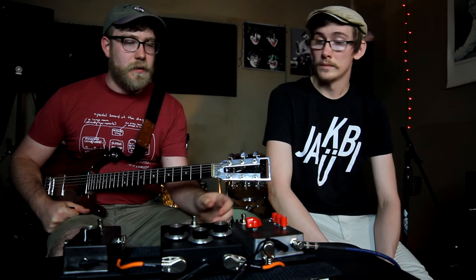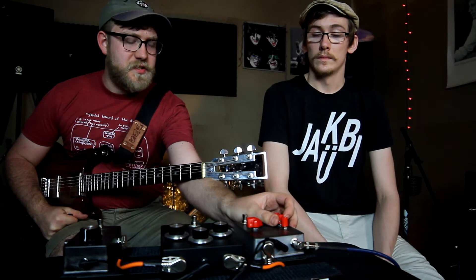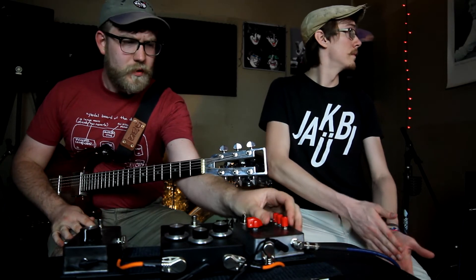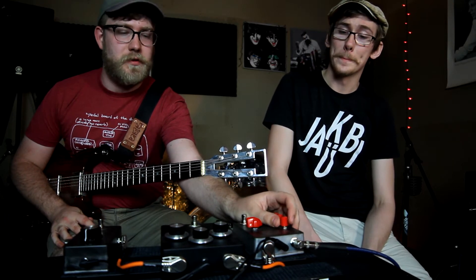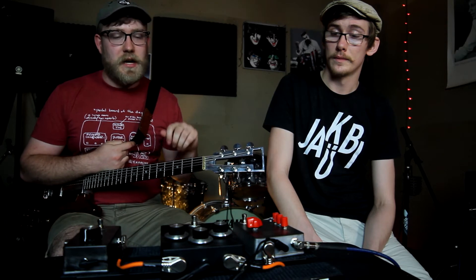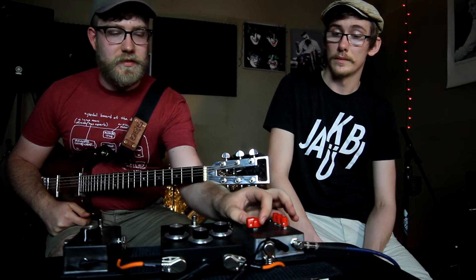And finally we have the Mu Blaster. As I said before, it has an extreme amount of headroom — it can swing well over 14 volts peak to peak at the output, which really lets you drive your amp very hard. The controls are volume, boost, filter, and depth. Volume is pretty self-explanatory with a huge amount of range on tap. Boost is like a gain and presence control tied together — as you turn it up you get more distortion but also some nice high-end harmonics. The filter control lets you tame those harmonics if you want a darker sound. The depth control sets how much low frequency is passed from the first stage to the second — at a low setting the pedal has a more trebly character, and as you crank it up a lot of low end gets added in, which is great for bass players.